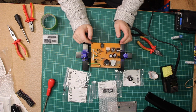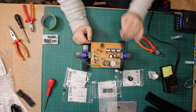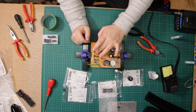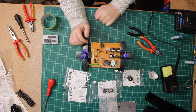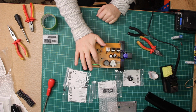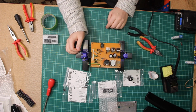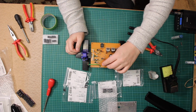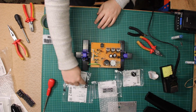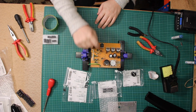Okay, this is the power board that's been taken out of the S-50. We're going to replace the capacitors. That one, that one, that one, that one, that one, that one, that one, and that one. We don't need to replace these. They shouldn't have gone. These are the ones we're trying to protect ourselves from. So laid out on the bench in front of me, I've got, that's the equivalent of that one. Those two, those 3 are 1, 2, 3, and those 2 are these 2 here.